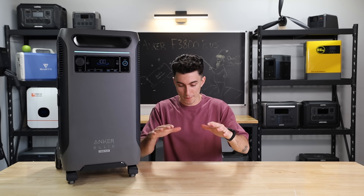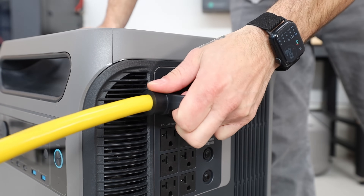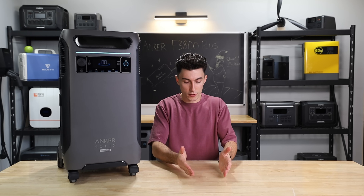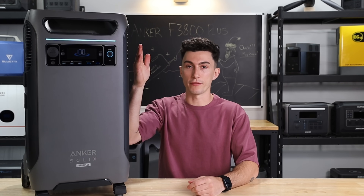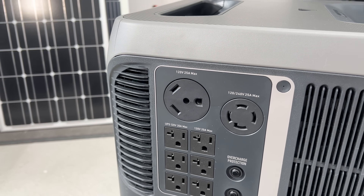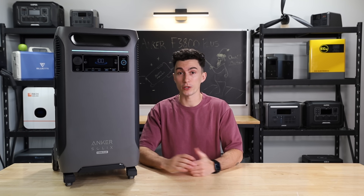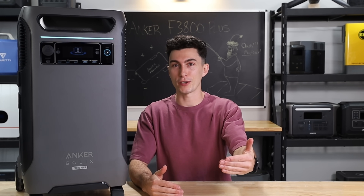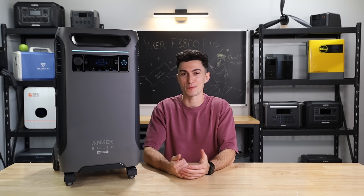The first thing we don't like is this 25-amp, so-called 30-amp plug. I get it — it's a 6,000-watt inverter and they didn't want to change it. To get 6,000 watts you need two legs of 3,000 at 120 volts, which means this is a 25-amp plug. If it were a real 30-amp plug, you'd have 7,200 watts on the inverter. I still think it's kind of dumb. We have such a big capable unit — they could have put a little effort into making that a true 30-amp, which would let you use it in a camper or trailer that expects 30 amps. I just don't like when we're at almost 30 amps — just give it to us.